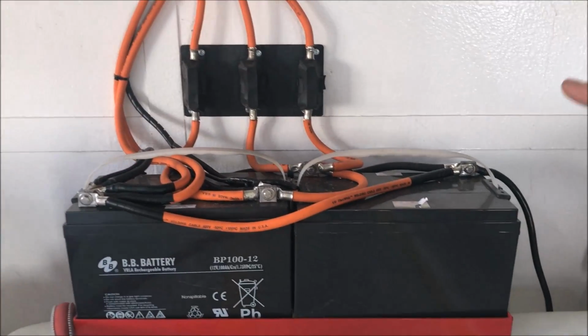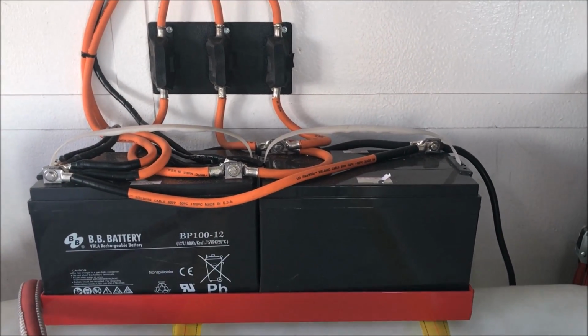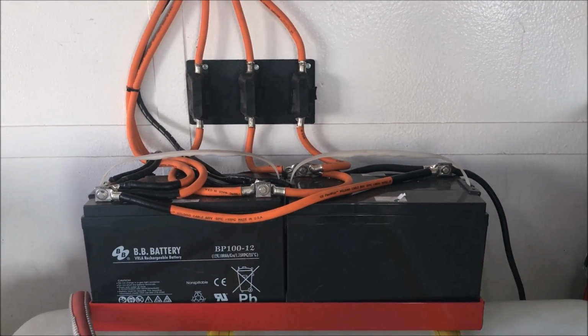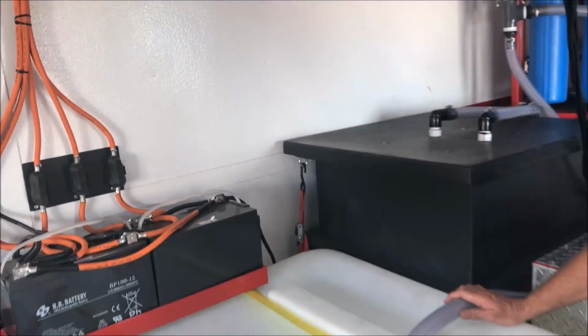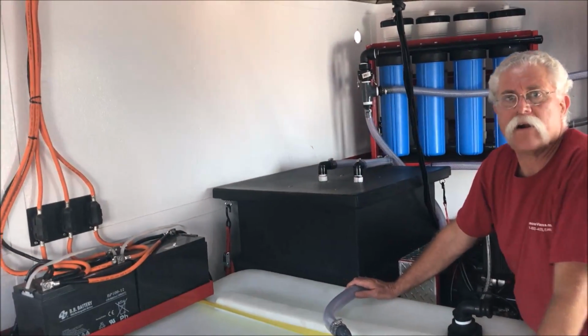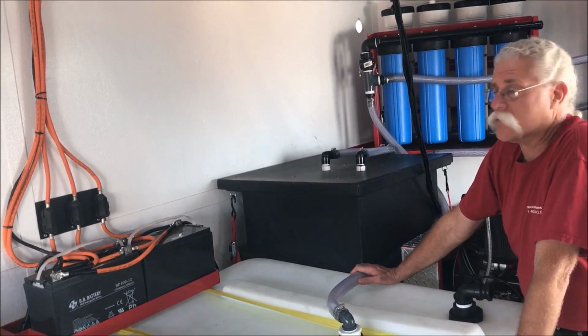So those are great big fuses, basically, on the batteries direct. Everything is oversized wire feeding these things. We basically have 4,000 watts of power going to 2,000 watt systems. So by oversizing wire, again, we're giving you abusability and reliability on electrical systems.